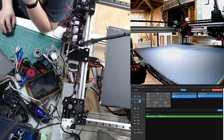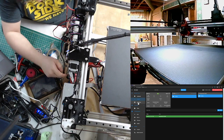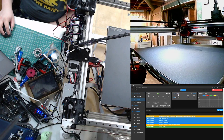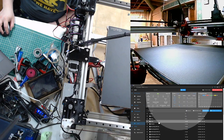Sometimes the beds are like that. There is a warranty tolerance for the bed flatness. So if your bed is really badly warped, one of the options the students can do is lay a straight edge across the bed, corner to corner, get a couple of pictures and send it off for warranty service. And Creality will send you a bed.